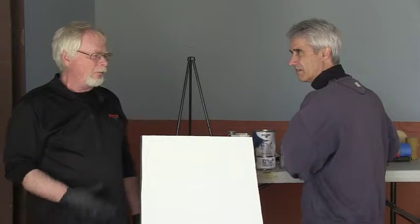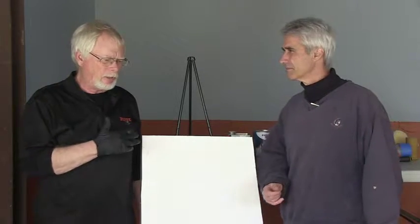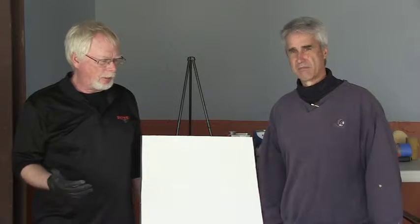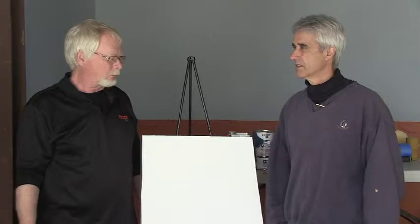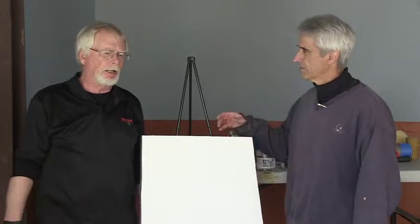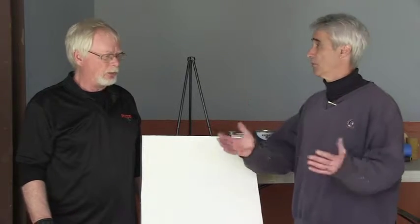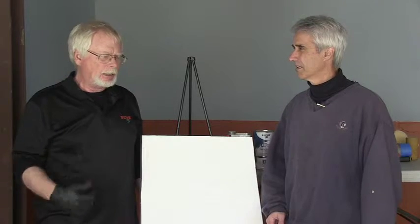Sure. The primer you have in your hands is very universally used. It can be used underneath our two-part paints or our single-part paints. It can also be used on porous substrates or things like reinforced fiberglass that are stabilized. With porous substrates, you always use the primer. Porous being like wood. You thin it down and drive it into the grain, and that's absolutely necessary.